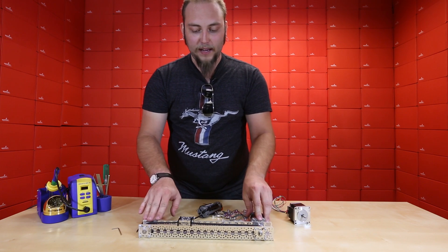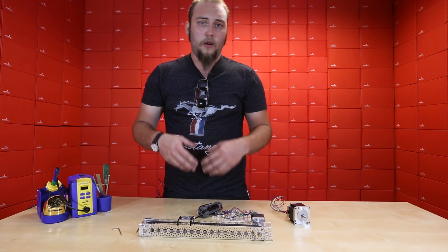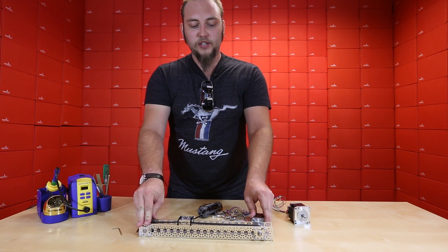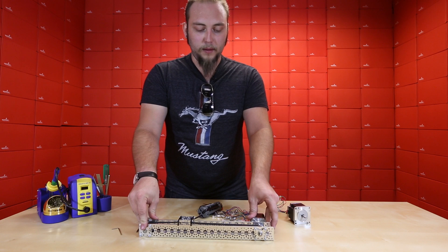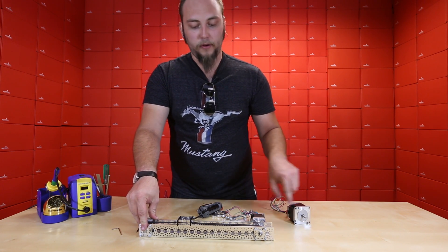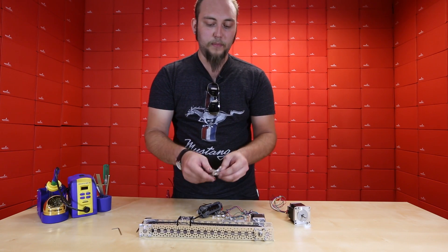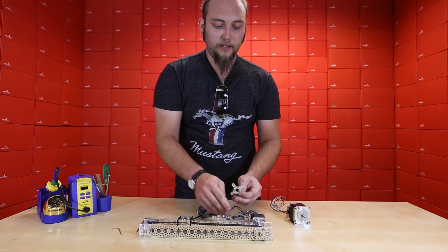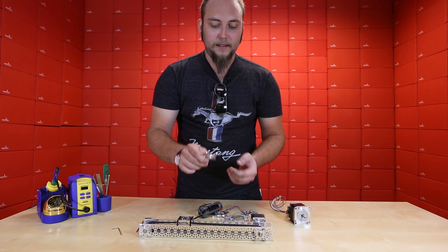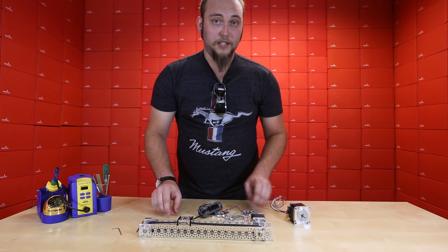This is an excellent way to connect stepper motors if you want to do something like a 3D printer, a chart recorder, or a small CNC mill — applications where you need this sort of precision and repeatability. These brackets make it very easy to attach the stepper motors to your channels. A lot of the time you'll need some standoffs between the mount and the channel so that you have enough space to get everything on your drive shaft, but these are excellent little pieces of machining and I recommend them for any stepper motor project that you have.